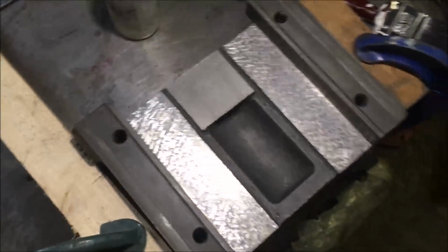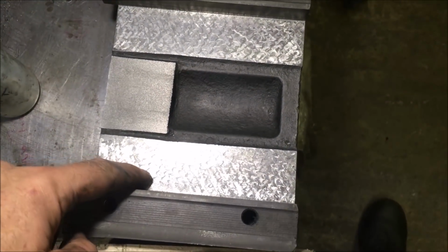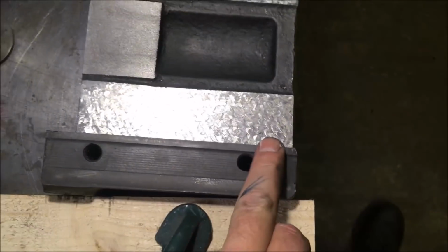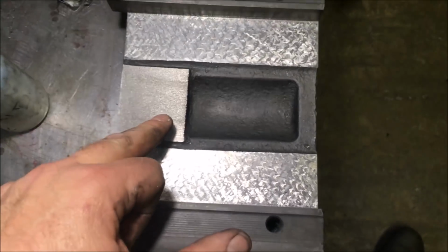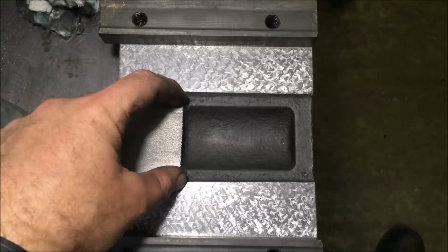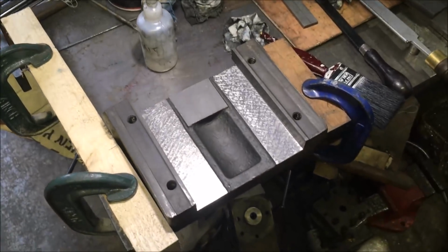Anyway, it's bedded on now, so the last job on this fixed off will be measuring that height down against that web thickness, and then I'll probably hand file those down. That'll give me the clamping plate pinch, and then I've got to work out my hole centres for drilling to then mount a block, which will be the next job. So there we go.